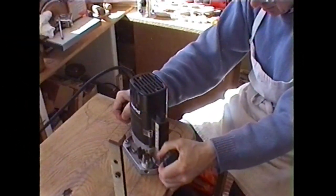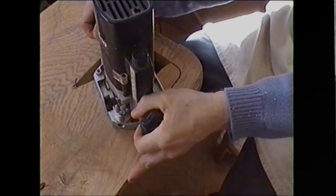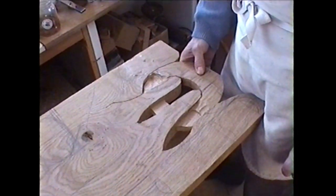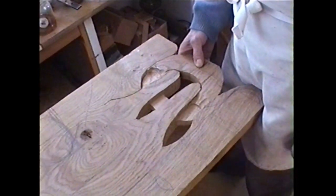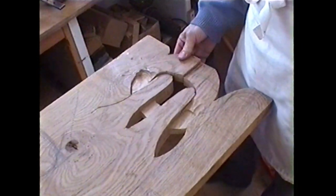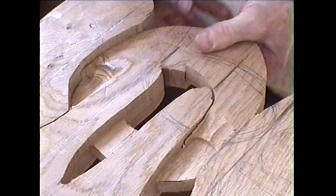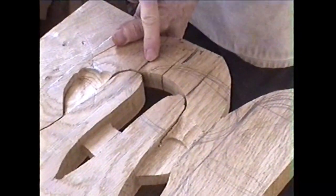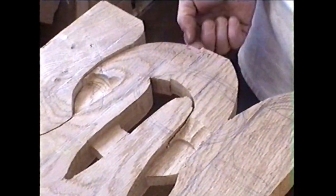Here is that moment — this is actually where the project goes wrong, and it very much throws the project into a little mini crisis. It was the only occasion we used a power tool. We tried to use a router to take away some of the bulk of the wood around the link, just to speed things up and reduce the pushing involved. But unfortunately, as you can see on screen, it split the link. There are two reasons: firstly, the vibration of the router, but also when wood dries out it naturally opens up, and splits had opened at the end of that piece of wood, causing the link to break.